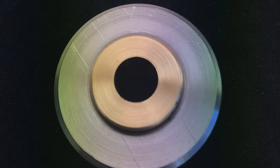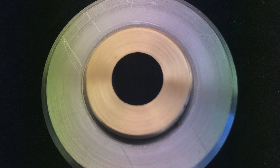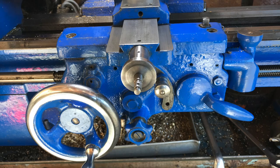This is the end view of the dial after I turned it and placed the bush. The small diameter is three-eighths of an inch and the external diameter is 20 millimeters, and the thickness of the hat rim is about three millimeters. The reason I made the wall of the sleeve so thick is because it has to accommodate a grub screw, which has to be done up quite tight on the shaft to ensure it doesn't slip.